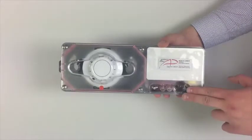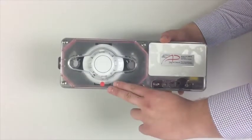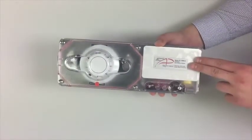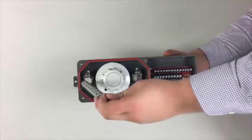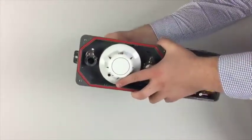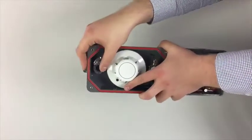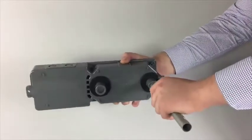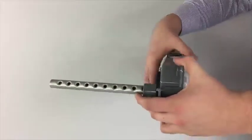The cover also features the reset switch, test port valves for smoke testing, LED indicator lights for alarm and pilot status, and the clearly marked label indicating the model of the detector. Sampling tubes can be front or rear mounted. The tubes have a notch which indicates where the sampling holes, or in this case the fast tube sampling channel, are located. Once the installer determines the position of the airflow, they insert the tube into the duct so the airflow flows into the holes or channel.